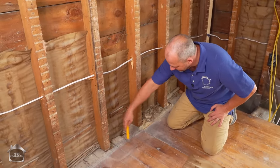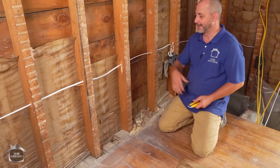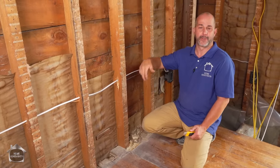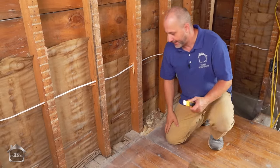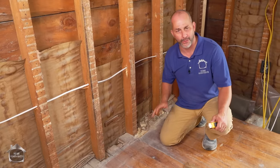Because the technology and understanding was so poor back then, they'd have the flooring guy come inside the stud bay — and that totally interrupts the thermal break. There's no such thing as an interior vapor barrier in these walls. Any air pushed through this wall is just coming right into the room, especially around the floors. When the air and the draft is bad around the floors, the house just feels cold all the time.